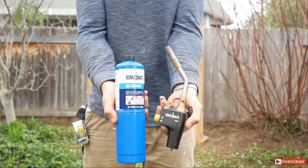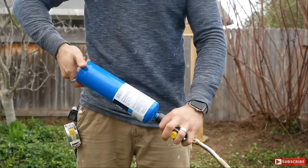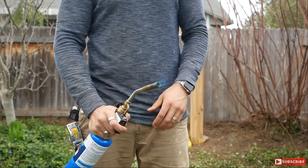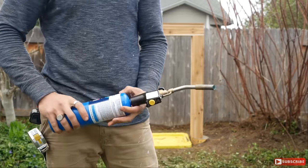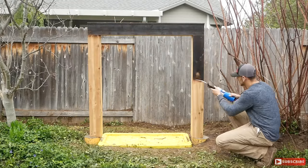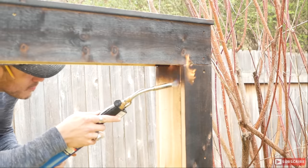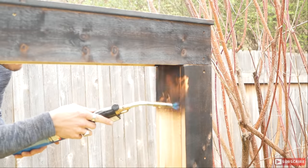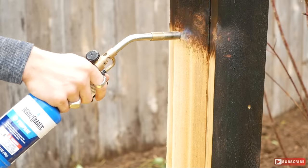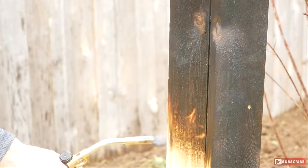Now for the fun part. We're gonna weatherproof this project using an ancient Japanese wood preserving technique called the Shou Sugi Ban technique. The basic idea behind it is burning or charring the wood, which in this situation we're doing using the Bernzomatic — the sponsor of this project — with propane gas along with the Bernzomatic TS8000 torch. This will give me an even control of the flame. I'm gonna take my time, allowing the wood to burn to any degree that I want. In my situation, I want it to be as black as possible — you can even get it as far as having that alligator-skin burnt campfire look.